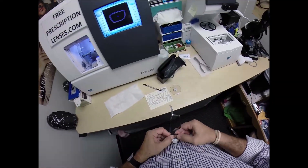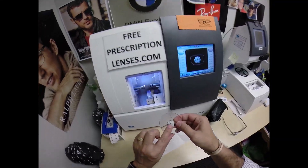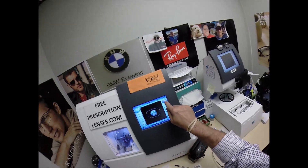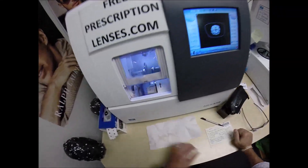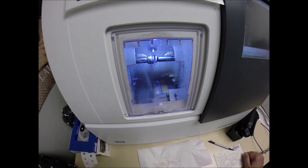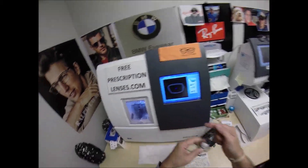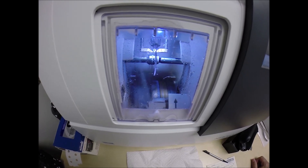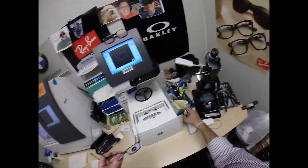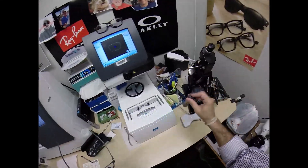I tuck the right lens in at the outside corner and press down with my thumbs — it snaps right in. For the left lens, I place the magnet into the chuck — tonight I'm calling it the Jesse. It's already been flipped over to L, which is Latin for 'not right.' I hit the green button just like before: the door closes, the clamp shuts, and the lens is traced by the two white styluses, making sure it's large enough to fit the frame, then measuring thickness to precisely place the bevel.